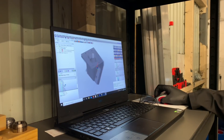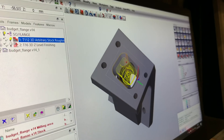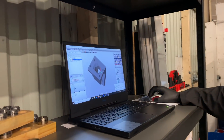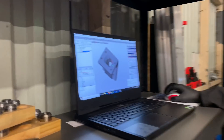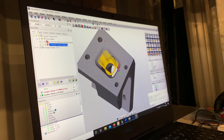When you have a model of whatever you want to create, you can start allocating toolpaths to it. We've got roughing passes here — that's roughing out this shape, and it looks like a load of stairs, stepped. You often see that with billet collectors — they leave the steps in, and to the untrained eye it looks really cool, but apparently that's not the right finish. Then we've assigned some finishing passes — you can see there are a lot more lines. That's for taking finer cuts at much higher feed rates so we can get a nice finish.